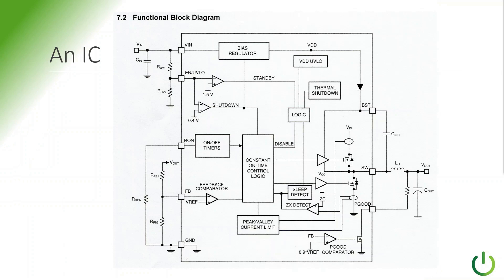Knowing that the logic works, we start looking for integrated circuits that are going to implement that logic. Here is an integrated circuit, or IC. This particular one is a pulse width modulator — it's for the DC to DC converter. Everything inside the rectangle is what's actually inside that small integrated circuit, and everything on the outside is what hooks to the pins. You have to supply that to customize it for the way you want your circuit to work.